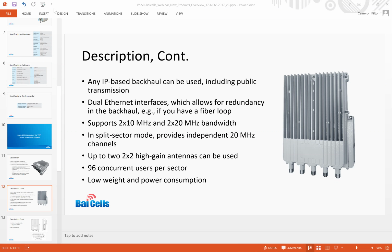So you could, in a sense, do a fiber ring if you did fiber up and wanted to link the two together via copper, and you could have fiber down on another, and you'd be able to turn on and off that switch. Of course, it'd be in a manual sense for now until we enable some other things like LACP and whatnot.